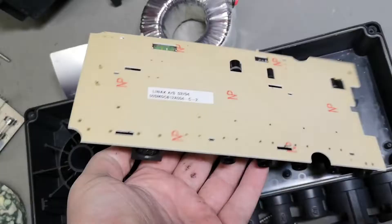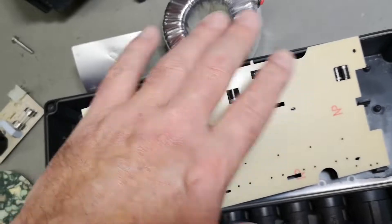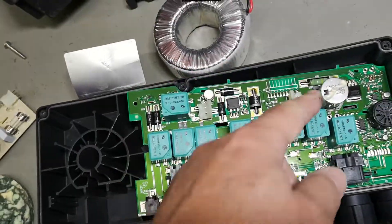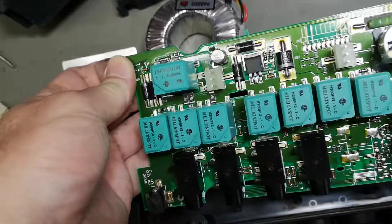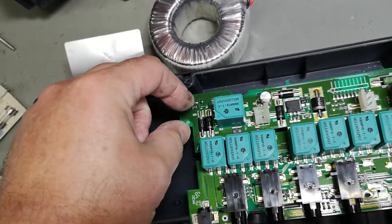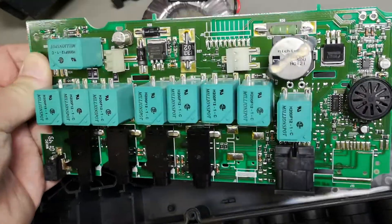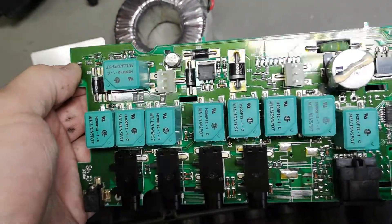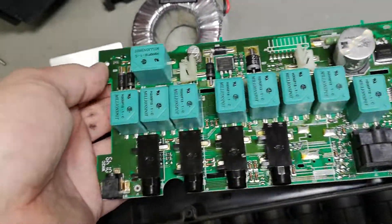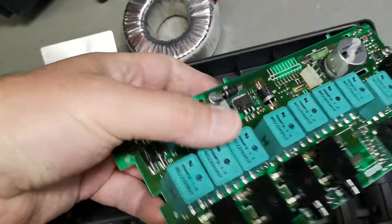It's super simple with some relays and some buttons. It's a single-layer board. There's a funny thing about the cutouts here — it's not because they care about height, because we've got plenty of height. It's because you just put in those big powerful components and now they're not going to roll off the board — they're stuck into the hole, so they're fixed. Then it's all manufacturable by the normal SMD process. That is how you do it as fast, easy, and cheap as possible. Genius — I love it. Really beautiful relays as well.